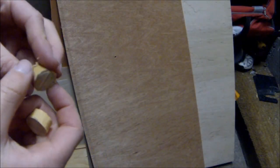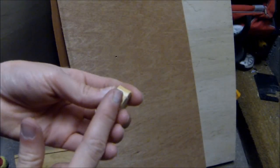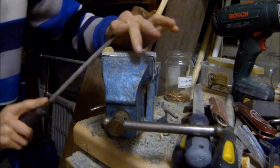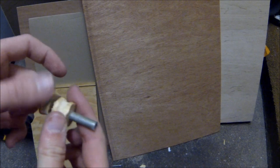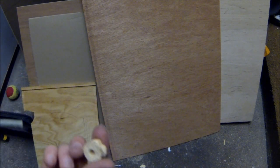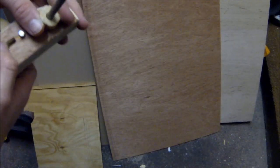I'm going to start with the same thick nail as before and cut off one centimeter of some hard wooden dowel — it can't be softwood, it needs to be a hardwood dowel. I use a rat-tail file to file a groove all the way around the wooden dowel for the string to sit into. You need to do this on both pieces. Once I've filed the groove all the way through, I use my drill press to drill a hole straight through the middle of the wooden dowel, and once done it can be put onto the bolt and spin freely.